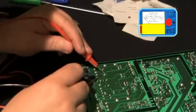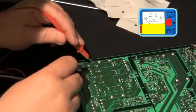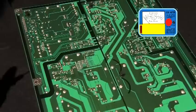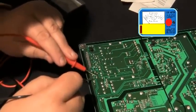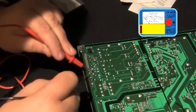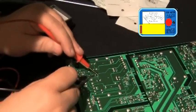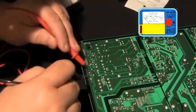The remaining series resistance is due to the electrolyte between the capacitor plates and indicates the state of dryness. Capacitor termination problems also show up plainly due to the continuous ohmic reading. A good electrolytic capacitor should always read very close to 0 ohms on an ESR meter. Checking all electrolytic capacitors on a printed circuit board of a power supply and replacing the bad capacitors repairs the power supply 90% of the time.